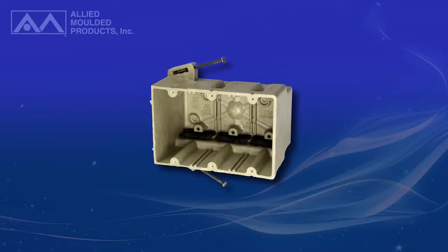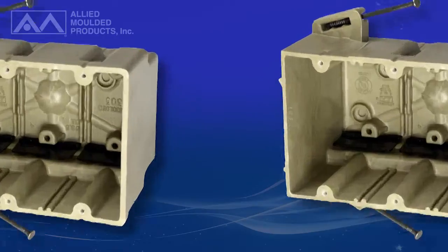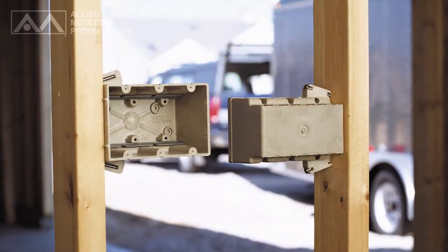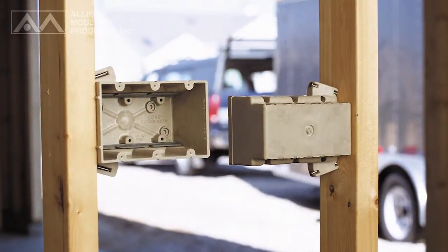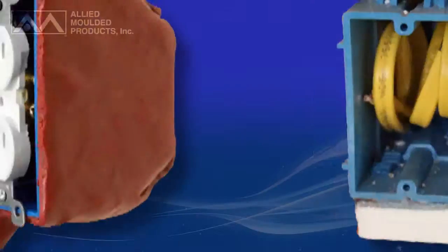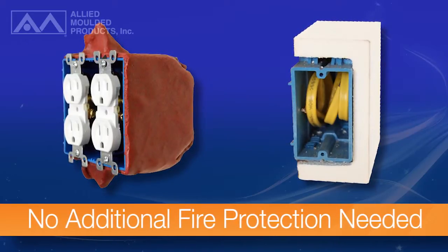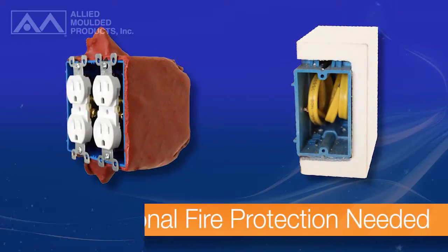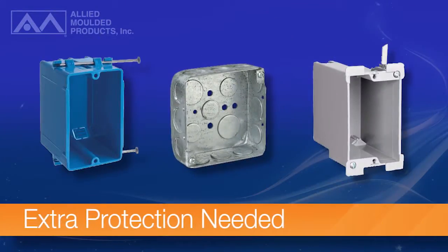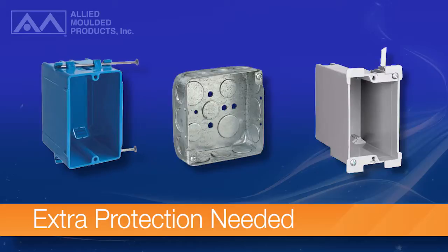Our series of fiberglass wall boxes, up to and including two three gangs, can be safely mounted in the same stud cavity on opposite sides of the wall within three inches horizontally in all U300 series wall configurations, without the use of additional fire protection like putty pads, mineral wool or insulation. Thermoplastic and metal counterparts can't be located closer than two feet of each other without additional fire-resistive materials and installation cost.